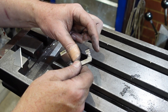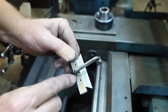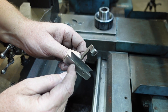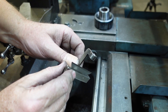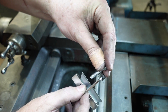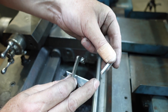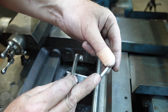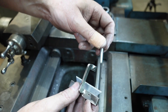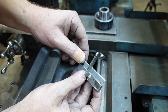I then need to make the screw for the end here and put a little brass tip on the end of that. I've now drilled and tapped the M3 grub screws. I had to go right the way through because that material is just too thin to stop halfway. The threads are rolled and there's a little bit of a raised rim — if I put that on material it's going to scuff it up, so I'm going to put a small hole in there, probably three or three and a half, and make a little brass pin to act as a bearing surface. Once I've finished this I'm going to take those corners off because they are quite dangerous.